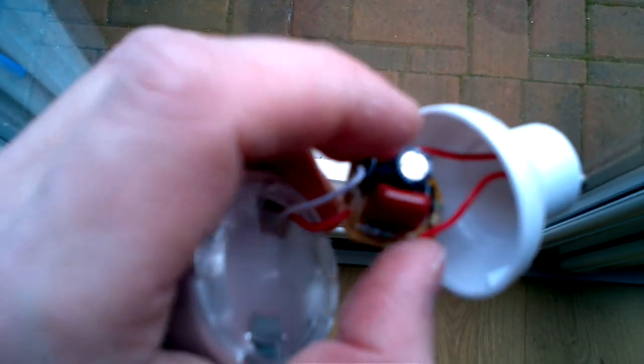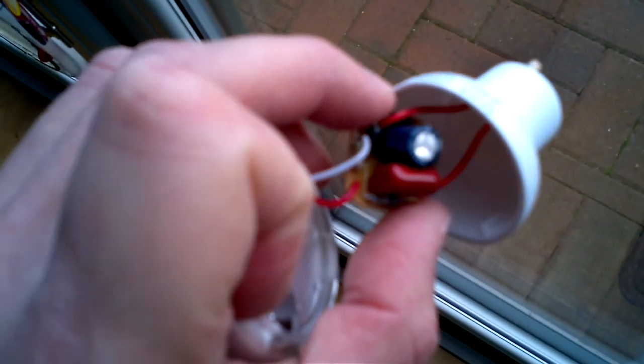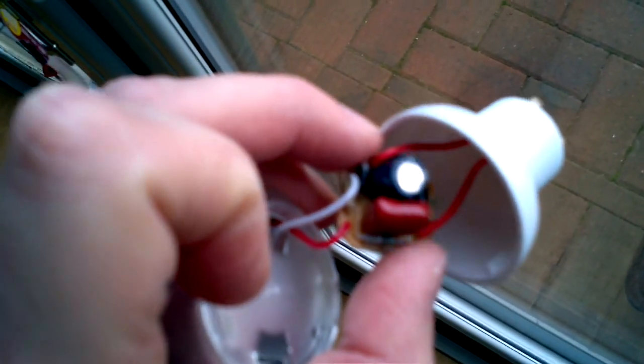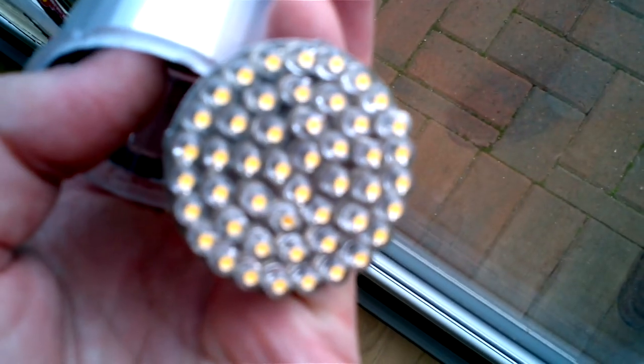So there are other things on here, these capacitors and a few resistors, that are on there to try and smooth that out. Now, each of these electronic components will have some tolerance associated with it. And one of the ways you can get your costs down when you're building them is to buy components with lower tolerances. Now, I haven't looked them up for these particular components, but basically if they have done that, then that means that they haven't smoothed out that AC as well as they could have, and that could cause this little burnout because the current will be too high.